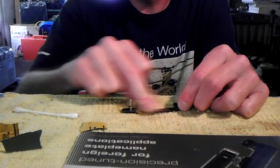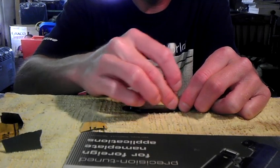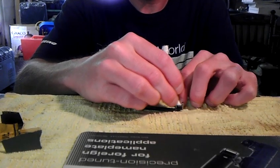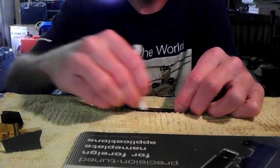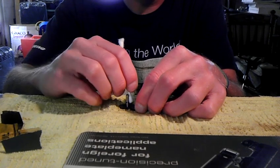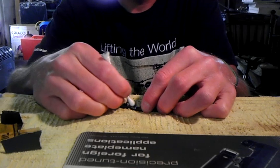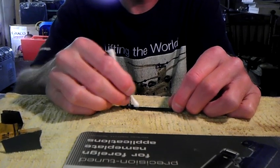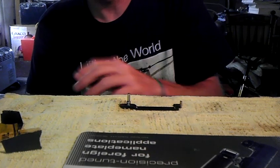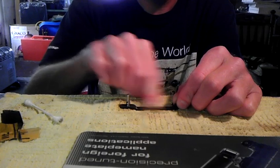I just want to quickly show you how to smooth your trigger pull on a stock Beretta. You can do all kinds of work — trigger springs, buy a spring kit like a Wolff spring kit — but the purpose of this video is just to show you an easy way using sandpaper that costs a few dollars and basic hand tools. I don't recommend using sanding blocks — just use your hand and finger, keep even pressure, keep your finger flat, and work it back and forth.